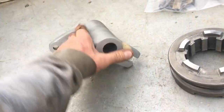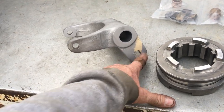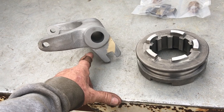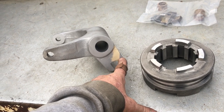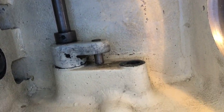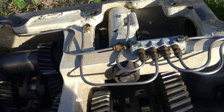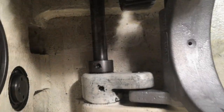Here's the repaired fork — this is the original fork that came out of my lathe when I bought it, already with the ear broke off. This repair is now a chunk of steel brazed to the cast iron. Cast iron is garbage, and it's much stronger now with a lot more weld as you've seen in the video. Got the headstock all cleaned up as good as I'm going to get it, so it's ready to start getting the fork in and the shaft back in. Got the fork back in — definitely a repair nobody will probably ever see.